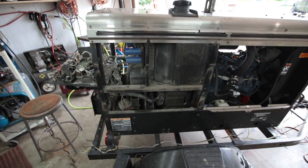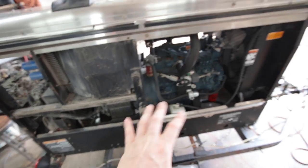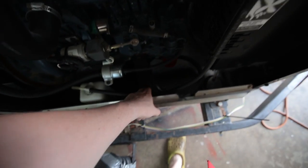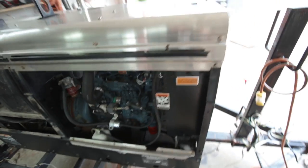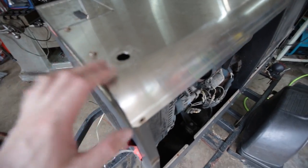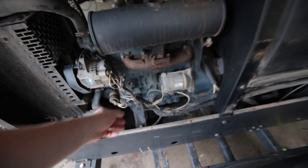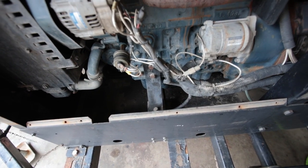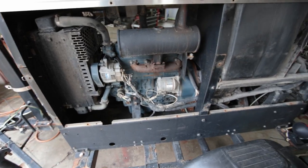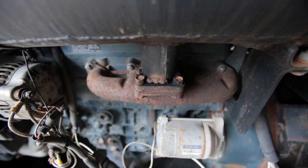I've had a little bit of time to play with this guy — took the sides off, kind of inspecting everything. Everything looks to be in pretty good working order. My brushes are good — sadly I was hoping the brushes were the problem. The engine looks really good. I just have a motor mount down there that has to be replaced. Sheet metal's in good shape. I have a hole up here from where I'm assuming it was some kind of LoJack-type deal — there was a little GPS or cell phone antenna I had to fix. There's a broken spade connector on my oil pressure sender, but hoses and everything look good.